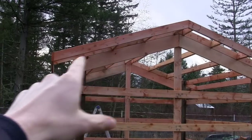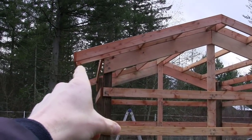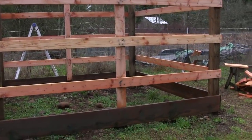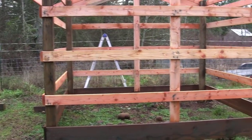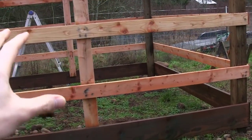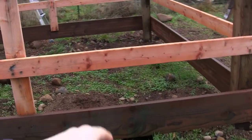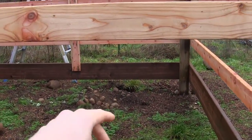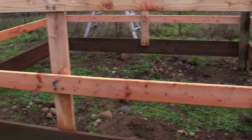All right, so there it is. We've got our 12 by 12 pole barn. Then I've got the roof with the overhangs of 18 inches on this side and then 16 inches on the front and the back. The first thing you'll notice is I don't have any doors to get into this thing, but I told you in the last video, I'm gonna put doors in. I just wanted to get it all framed up. So I've got some pressure treated 4x6s that are gonna go in this hole down here and that one over there, and then we'll frame out the doors. I'll show that in the next video.